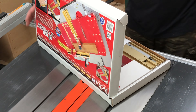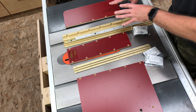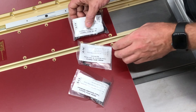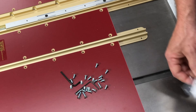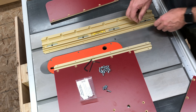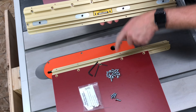The first step is to decide if you're going to set this up on the right side or the left side of the blade. My blade tilts to the left, so the directions recommend setting it up to the right side of the blade if your blade tilts left, so that's what I'm going to do. Then the next step is lining up these panels and connectors using the hardware packs, which are really nicely labeled — we've got C13, C14, and C15. Also, this guide plate is lined up so that the small T-slot is on the side of the blade, and there's a little caution arrow indicating where the blade is.